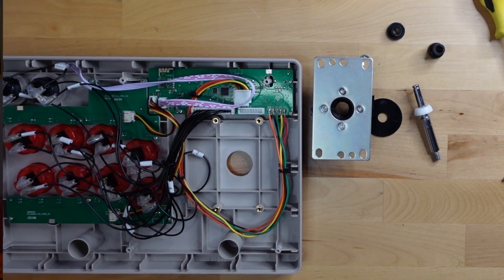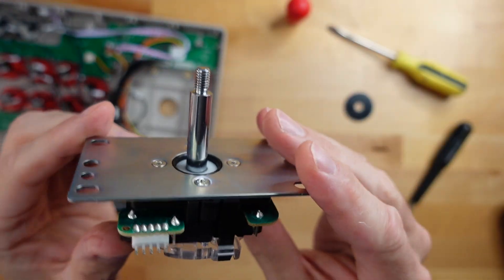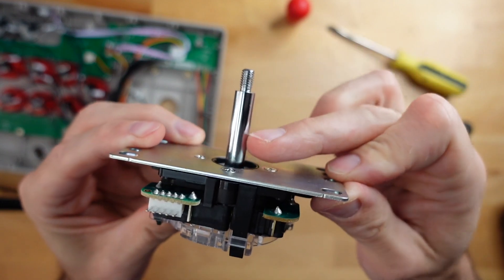I like how simple arcade sticks are at their core. It's just buttons with two wires, a ground and a live one. And a stick is a really mechanical device — you can understand it. It's just a shaft that's hitting micro switches. There's five wires that come from it: up, down, left, right and ground. The PCB that runs an arcade stick doesn't have to be fancy. All it's got to do is take those five inputs and transcode them into whatever the controller or USB is. You can certainly get super fancy arcade sticks with turbo, programmable macros and multiple system support. But a stick at its core can be really simple, and I like that.